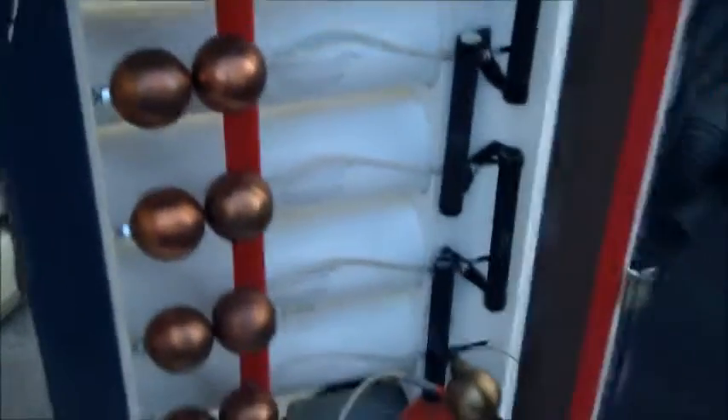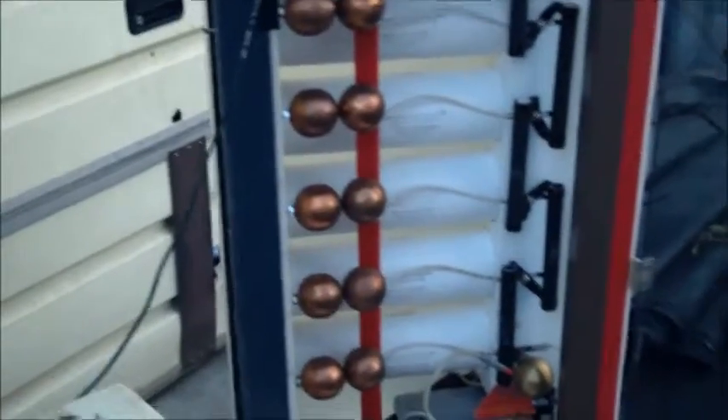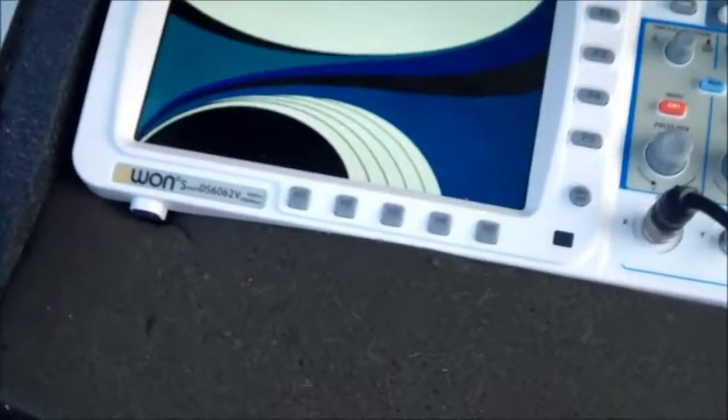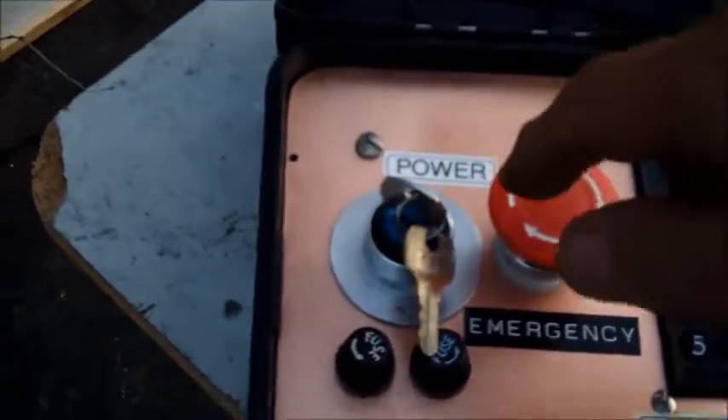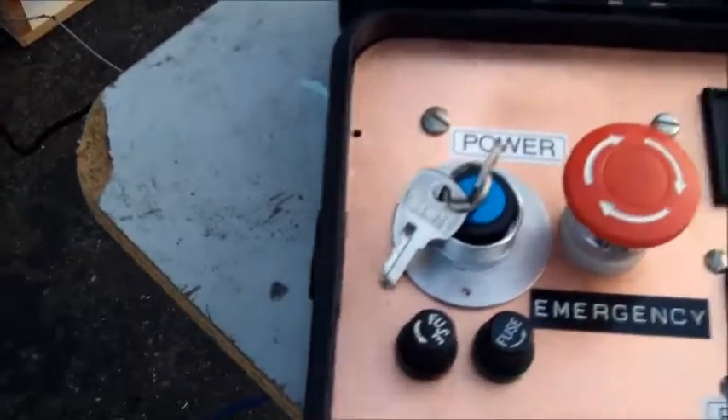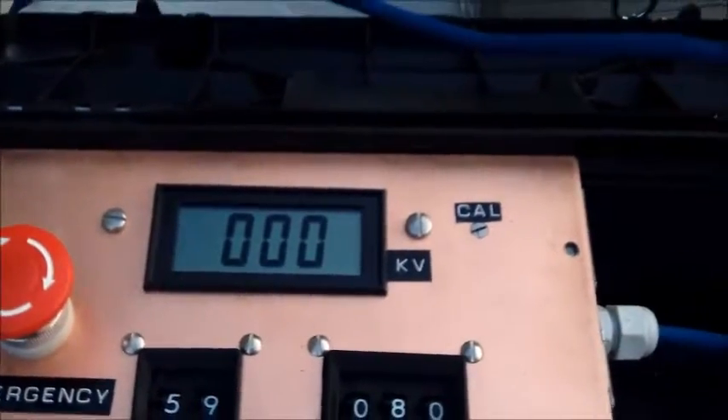This vertical resistor is 400 megohm, which senses the DC charging voltage. This is the shorting solenoid arm. The turn-on switch is above this line. It takes a few seconds to be able to operate. Turn it on — this is the controller. The controller has a main power switch which must be turned on, and the digital panel meter shows zero.